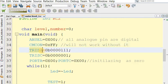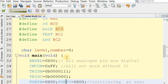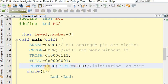We write ANSEL equal to 0x00 which means all I/O pins are digital. The comparator configuration must also be turned off, otherwise the controller may not work. For TRISA, the PIC16F676 has port A and port C. We write binary 00000111 indicating RA0, RA1, RA2 are inputs and RA3, RA4, RA5 are outputs. For TRISC, RC0 is input (switch S4) and the rest are outputs. Both ports are initialized to zero.